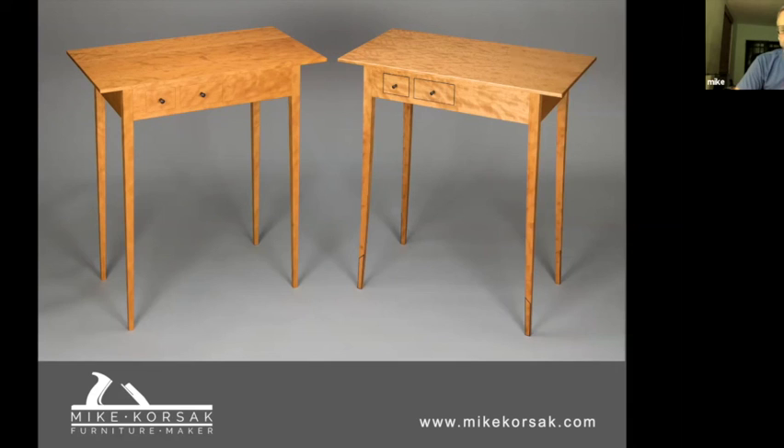I got a question for you — were those chairs comfortable? Yes they were. Were the splats set in place or were they loose so they could flex with the person? They were glued — only one end was glued, and I think that was the bottom end, so yes there was a little bit of flex and they could flex up into the mortises in the crest rail.